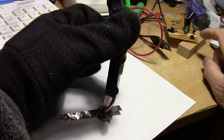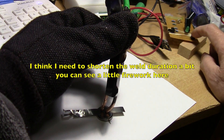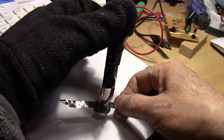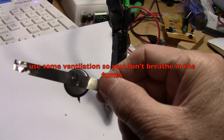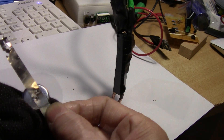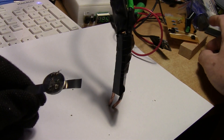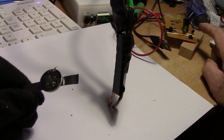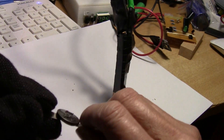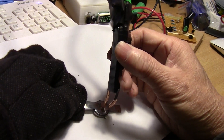I have a momentary switch here. This seems like a pretty solid weld. On this side I held the switch slightly too long, and on one of the welds on this side it actually blew a hole in the very thin strip.